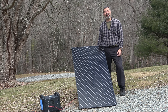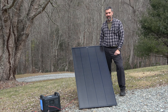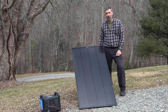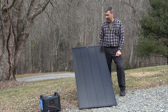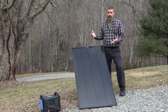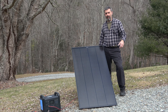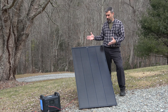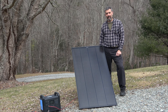There's no shade here because there's no sun — we are in full cloud cover. Even in a condition like this, where it looks like seven or eight o'clock at night in the summer, we are putting out about 40 to 50 watts out of the 200. This is the reason why — and again, a mistake I made early on — I thought 1200 watts, calculated hours of sunlight per day, and figured I'd be doing just fine. That's not often the case. These panels are rated for 200 watts maximum, but real world conditions with heavy cloud cover make it more difficult to hit those wattages.